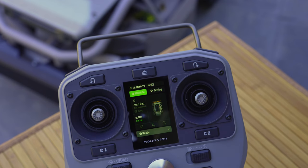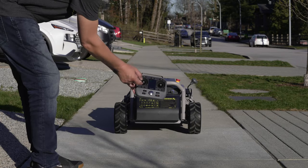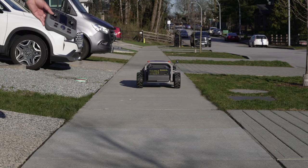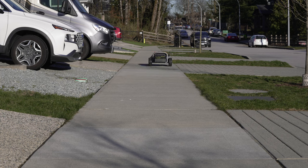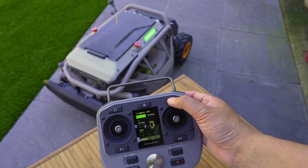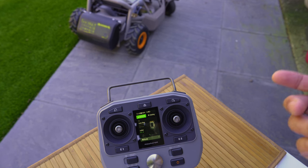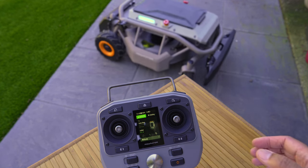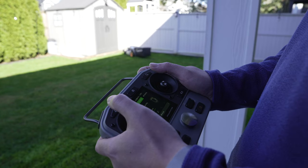It uses just the IMU measurements — basically an accelerometer — and it's going to try to keep you as straight as possible. Once you're using it you can make adjustments on the right stick to center it. I tried it on our long sidewalk and it went all the way down without any correction at all. Once you reach the end you can press the left or right 180-degree buttons — it'll turn the whole unit. I'm going to press the right turn now... there we go, it turned 180 degrees. Press it again and just that easy, you can go left or right.